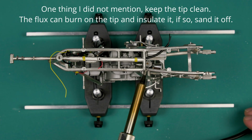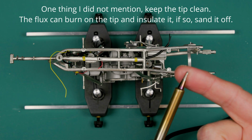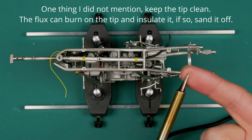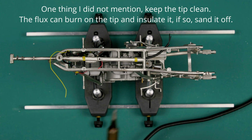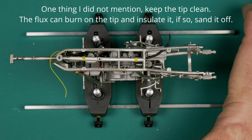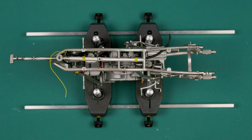You should just be touching it, right? It's hard to convey how hard you're pushing on something, but that's how hard I push on the material. I don't push. It's just basically the weight just resting on there. That's it. If that's not working, something's wrong. Stop, evaluate what's going on. If it means you have to clean everything again, give it a bit of a scuff up, a sand, a wash, whatever. Do it, reapply your flux, and try again.